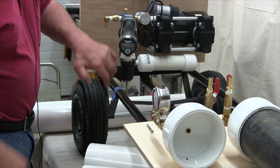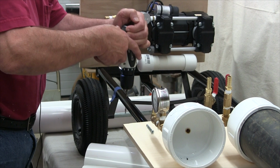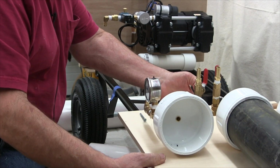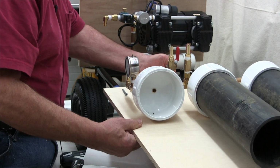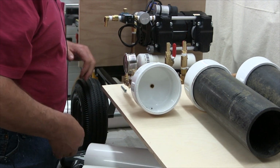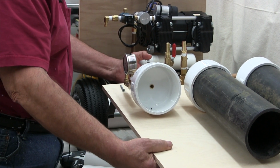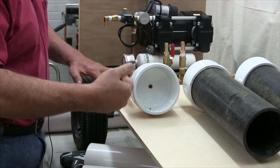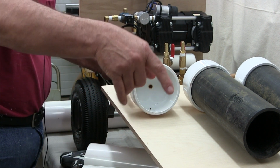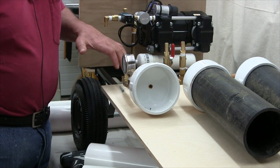So I was about to finish up the last of the holes here. So armed with that information, I slide the board up here. I've put tape down here on the leg of the hand truck to determine the optimum distance down the leg of the hand truck. And what I'll do here is clamp this board top and bottom, stand it up, and punch holes from the back side, and then install the bolts.